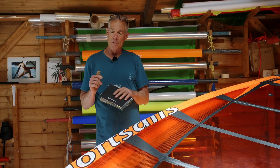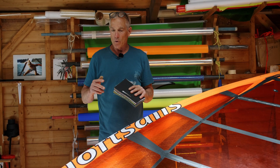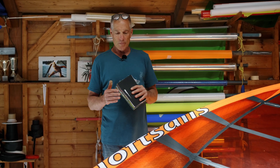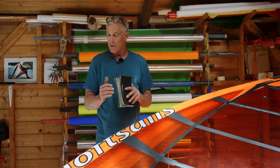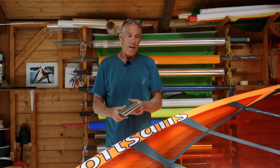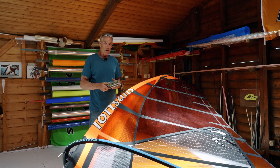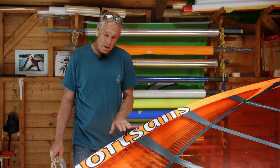One of the characteristics of wide mast pocket sails is that when you roll them up, the mast pocket on the outside of the roll will be under tension and the mast pocket on the inside will be in compression — making small folds as you roll up. Those small folds are really a problem for any other material. But this particular two-millimeter, which is very light, doesn't remember the folds, and for that reason we use it in the mast pocket sides.